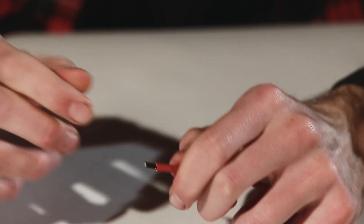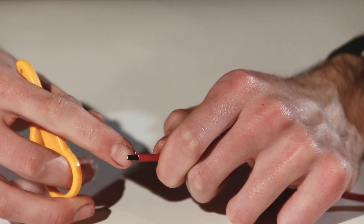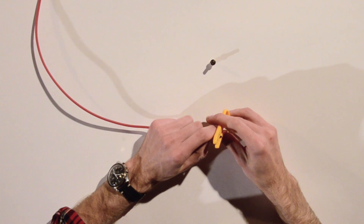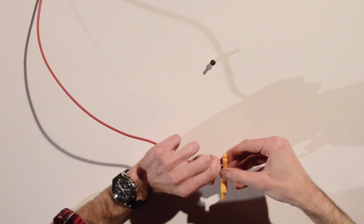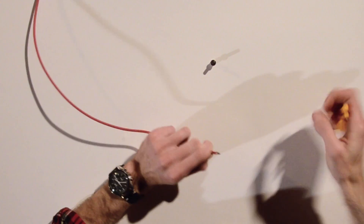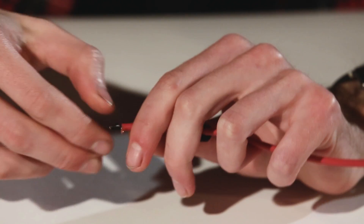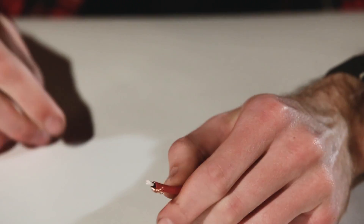Twist, twist, twist — you want it to look something like that. Your next step is to take off the outer black layer, so go back to your strip tool. I use the second-to-last setting — light pressure, just spin right around. If it doesn't rip off, that's okay — just use your fingernails to get it off, and that's about what you want to see.